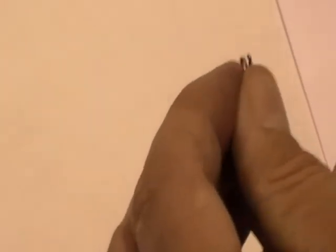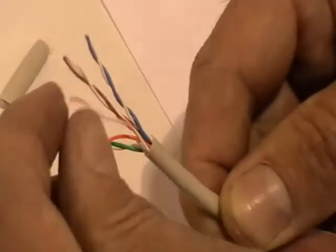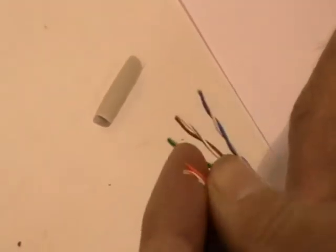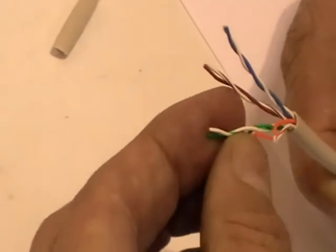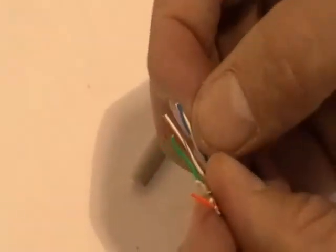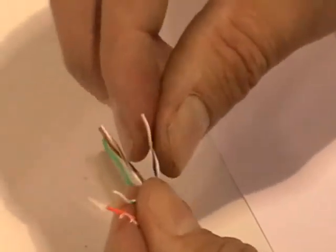Unfurling the cable, you can see that inside we have four sets of twisted pair cable. We need to untwist them and arrange them in the correct order. We start with orange-white, then orange, then move on to green-white. Strangely, we then deviate and place the blues directly after the green-white, so blue comes next, then blue-white, and then we come back to pick up the green from earlier.